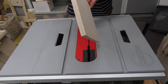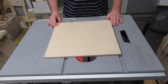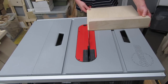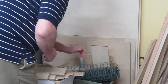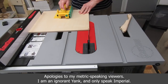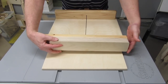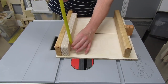I'm making the sled base out of ½ inch Baltic Birch plywood, but any half decent plywood will do — or probably most any kind of wood, for that matter. Your sled base should start off a little wider than your fences, wider by at least the width of your table saw's blade. The fences are 15¾ inches wide, so I cut the base to about 15⅞ inches wide. The depth is around 15½ inches. Both sets of fences are a little under 3 inches tall.